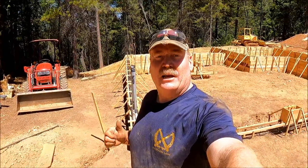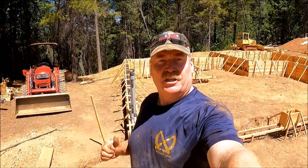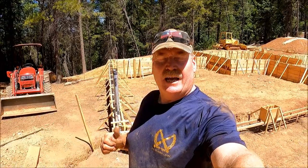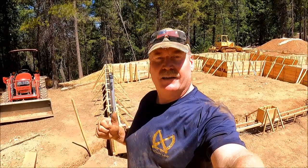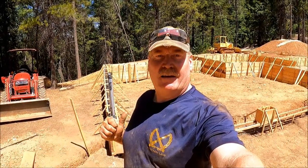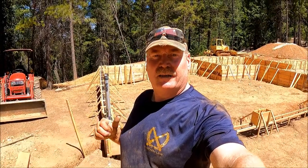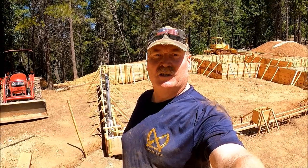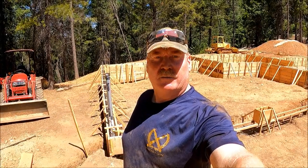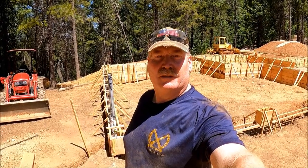So all the electrical and water, cable and TV has all been stubbed up through the foundation. So that is good to go for the cement pour. The only thing we have left to do is come back and clean up the trenches a little bit before the inspection, which I have a week from today. So the next video will be just the cleanup of the trenches and a few other things that I'm going to do, and have some tips for you before you pour concrete. It'll make life easier when you're pulling the forms later.